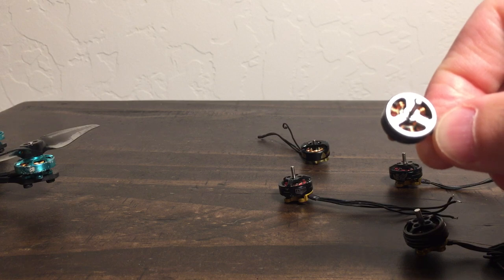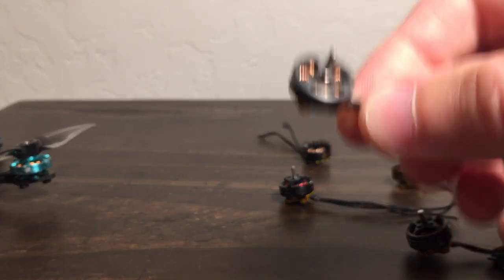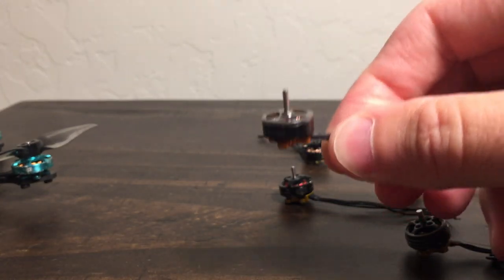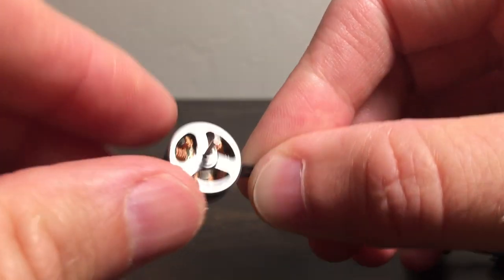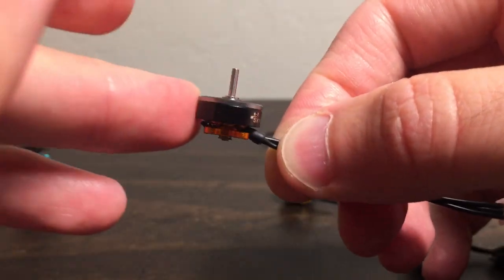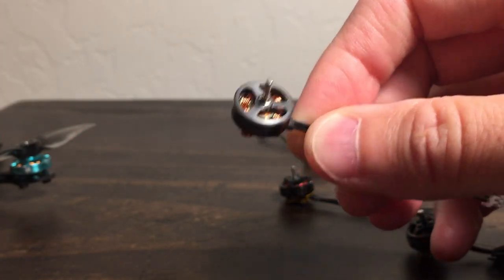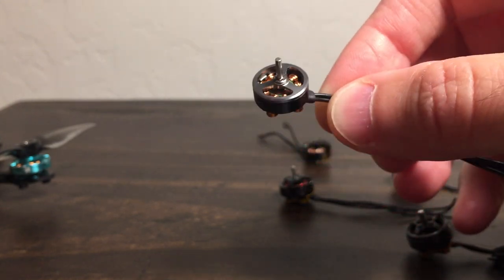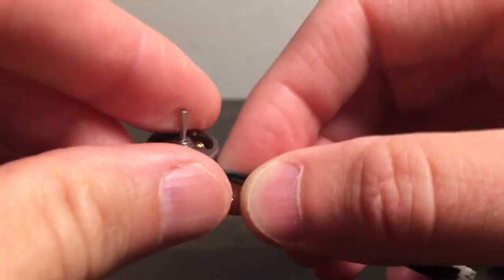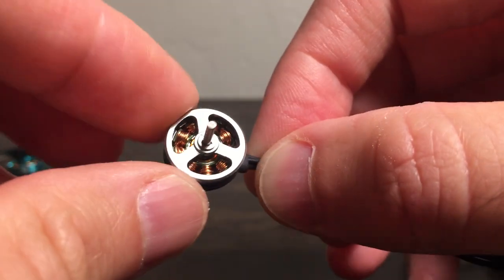You know what I'm gonna do? I'm gonna hypothesize, and then I'm gonna fly and see if I'm totally wrong. So currently, of the motors that I've been flying, my favorite motor to fly on the 3018s on 2S is these little Skystar 1103, 8,000 KV motors. The 11,000 actually feel a tiny bit better, but you give up a fair amount of efficiency without much benefit. I think the 8,000 KV is sort of the best. I think the reason I like these motors is because of the 1103s — until I got those AMAX motors — these are like the notchiest.